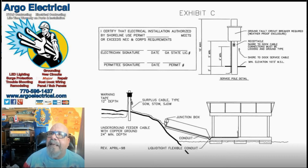There would be a junction box on the gangplank handrail. This needs to be — where I'm running the cursor right now — that needs to really be in a rigid pipe. You can use EMT conduit, but you would have to use the waterproof connectors. Then you would run the length of the gangplank in your conduit. You'd have a piece of flex where it crosses from the gangplank onto the main section.